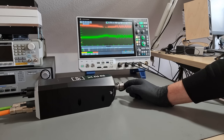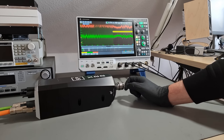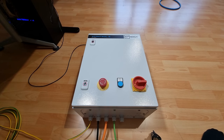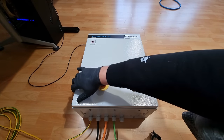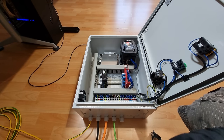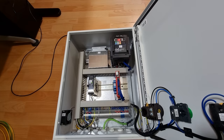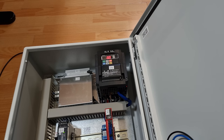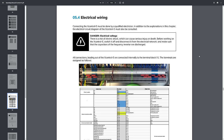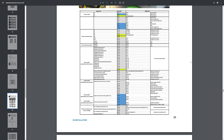That is all the sensors squeezed in here — not even some legacy SS41 Hall effect sensors to support commutation with simpler variable frequency drives. Until we get the encoder system going, we are essentially running the motor open loop — well, not quite. The Omron MX2 VFD comes configured for sensorless vector control, where it listens to back-EMF patterns to estimate the rotor position. That works for everything but the lowest RPM torque requirements. Let's see how we can talk to the VFD, make it start and stop, and command spindle frequencies and directions.